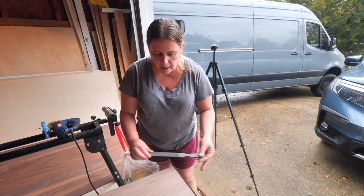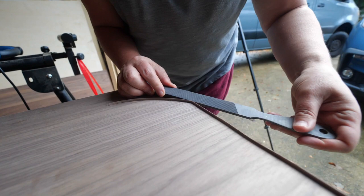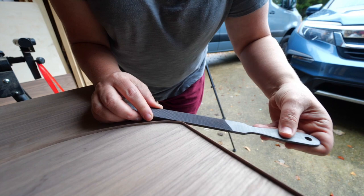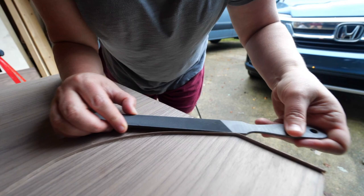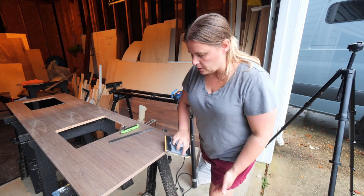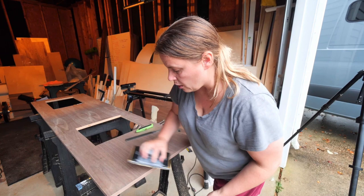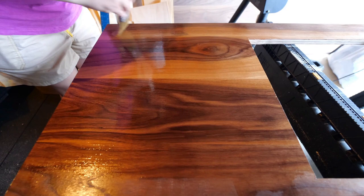Line the file up with the edge and go in one direction only, touching the wood. Keep it at a slight angle and try to keep it just a hair away from the table so you're not gouging the underside — especially if you can see the underside. Our countertop underside won't be visible, so if I mess up a little it's not a big deal. This is so easy compared to the knife. Then just like the top, sand the edge lightly, only inward. This stuff is so thin and fragile you really don't have to do much — just go across it a couple of times and it's done. Do that all the way around your countertop and you're good.